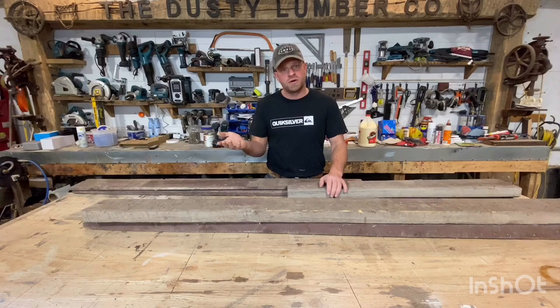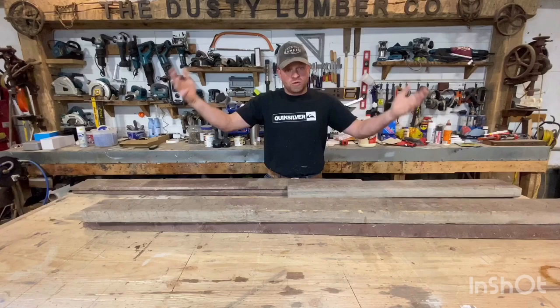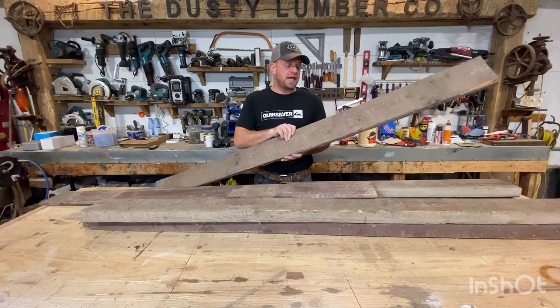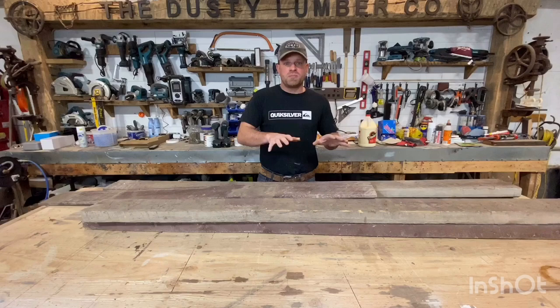It's not the prettiest material, but it is strong. It's also very flat and predictable, and it expands and contracts at about one-tenth the rate of normal wood. So I've got some two-by-sixes that we're going to rabbit cut and put around the whole outside so that when you're looking at it from the outside, it looks like you've got solid boards. I've also got some material that I'm going to mill down into barnwood veneers to go on the interior. We're going to glue everything down and leverage the strength of the plywood and the beauty of the barnwood to end up with a real nice table.